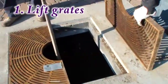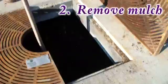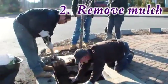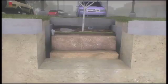Intermixed with the mulch layer will be the sediment and road grit, things of that nature. Once the protective grates are lifted, mulch is removed from the Filtera box with a shovel or with a hose attached to a vacuum truck. Garbage and sediment caught by the mulch are thereby also eliminated. If not removed routinely, sediment can eventually clog the engineered media at the base of the Filtera, shortening its lifespan.